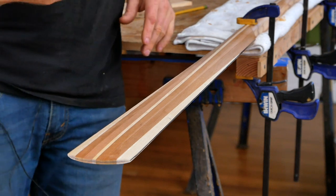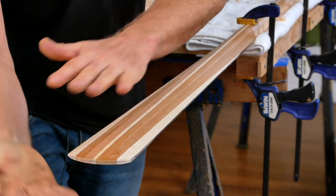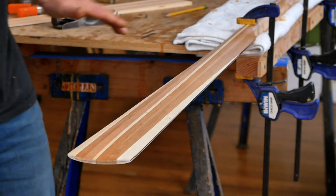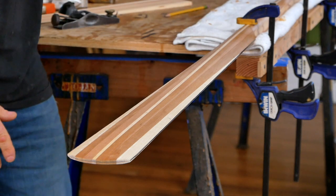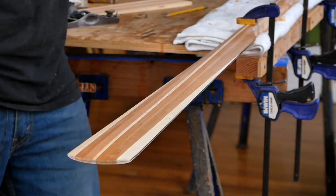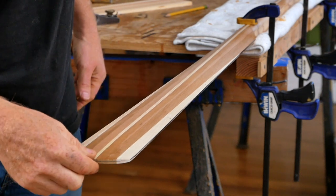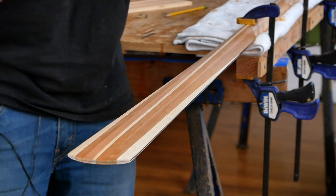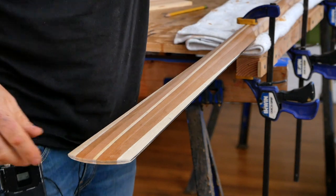There's always the chance I might try to get scientific about this in the future and quantify the deflection for different sizes and wood species. If I do, the way you'd run this test is to clamp it down to a very stiff workbench, clamp the root down at the edge of the table, put four clamps along the blade to completely isolate the flex, and then hang exactly a 10-pound weight off the end and measure the deflection.